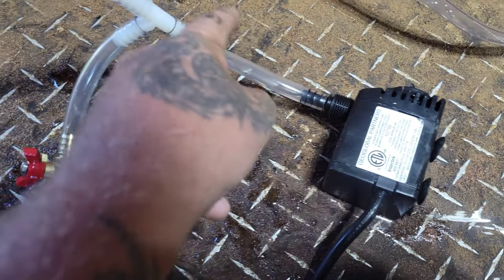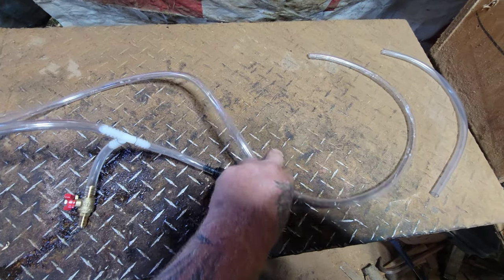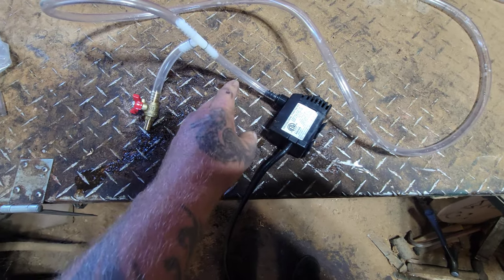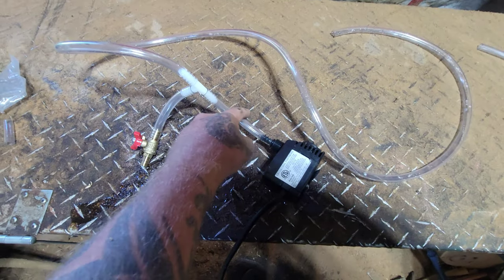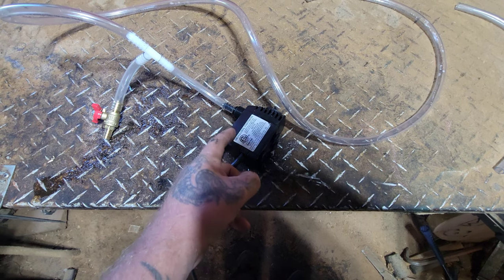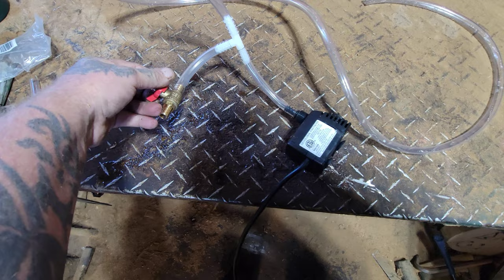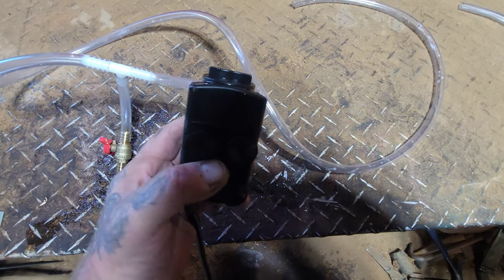So instead of just pumping all the water up into the top of the waterfall, let's see here. You know, this goes up top. Now, to release pressure, I can just open or close this valve, because once again, I can't have just a valve up here. If you have just a valve up here, pretend this isn't here, it's just one tube coming up, you're putting pressure on these pumps and you'll burn the pump out super quick. But there's a valve here, so I'm going to have this thing going full blast and I'm just going to control it with this. And then all the extra pressure will come out here. Does that make sense to you? So it's not hard on the bearings or this motor or whatever they say.